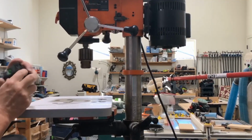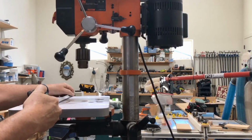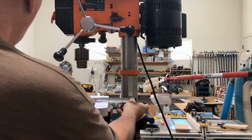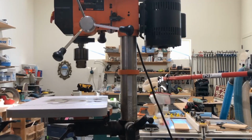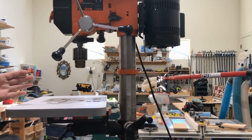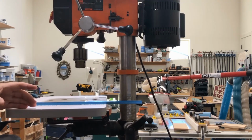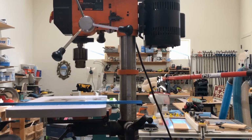For the drill press tabletop, I'll do it the same width because the PowerTech fence is the same, 24 inches. And because of the brackets, I need to go further back here, so it'll be 16. So 16 by 24. I plan on using 3/4 inch plywood as a first layer and then 1/2 inch as a second layer. This way, for the T-tracks, which are about 1/2 inch, I just put them in and then build it with separate pieces. That way I don't have to do any dado. So let's get started with that.